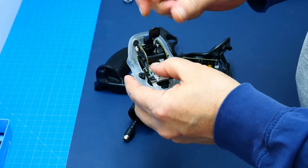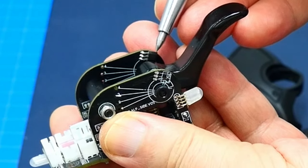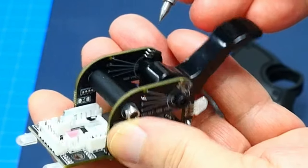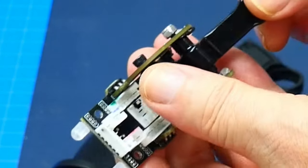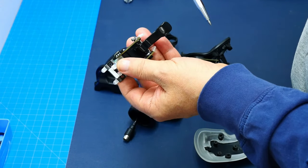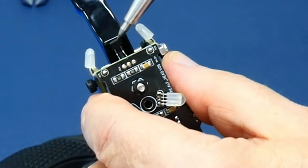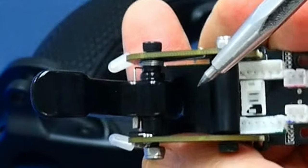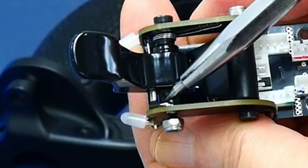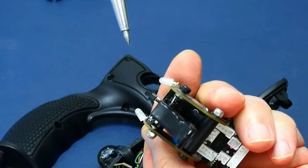There's also another hall sensor located right here, and the magnet for it is right here. This tells the chip here where that lever is located. So you have the full position when the magnet contacts this hall sensor. The magnet sits on one side of the hall sensor, and then sits on the other side when it's fully depressed.